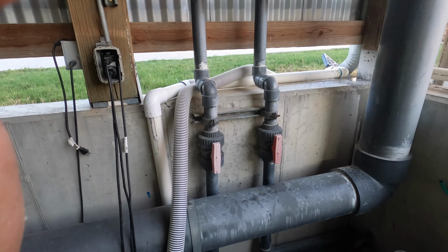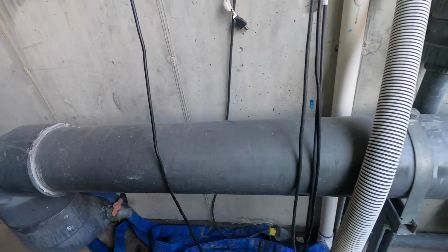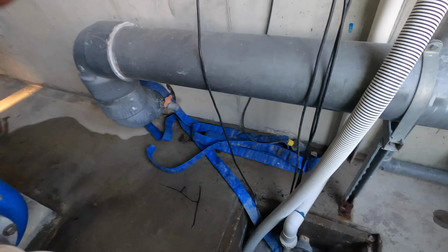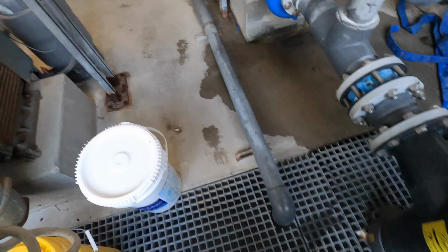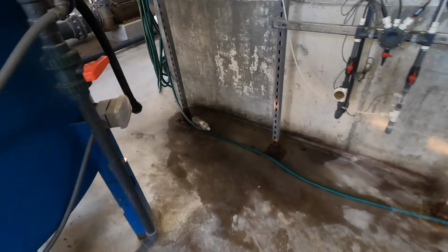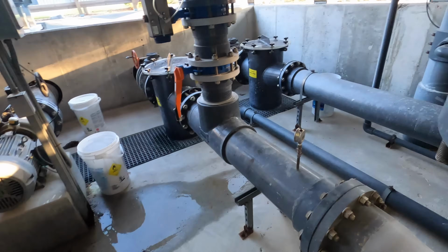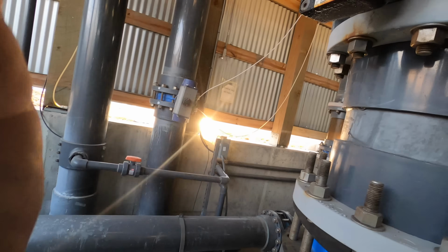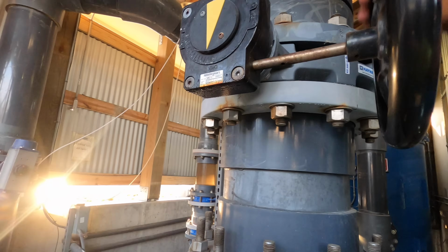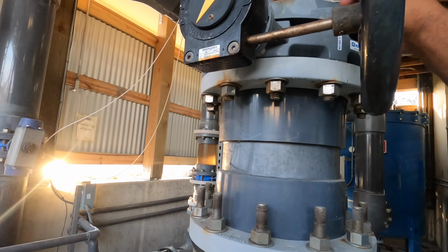There we go. Yummy. That's cool. Cool. Oh, it's smelly good. I'm kidding, it stinks. Another thing I'm going to do before I keep going is the effluent valve, or excuse me, the output valve on the motor, on the pump. I'm going to go ahead and shut it, because if not, it could actually cause not a venturi, but a siphon. There you go, that's the word.